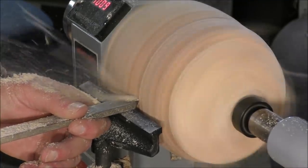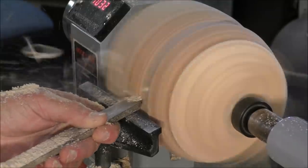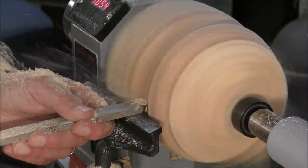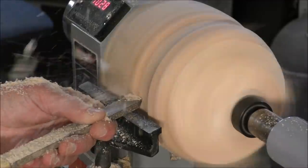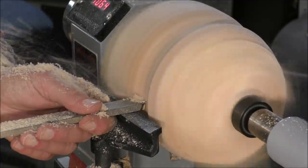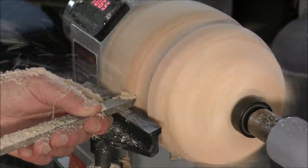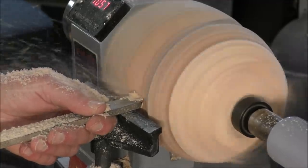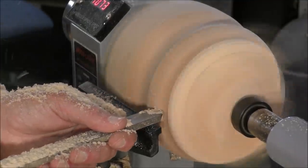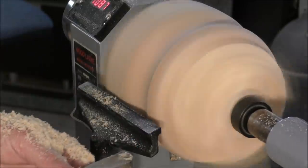We're actually going to do some of the shaping of the bowl now. I just don't want too plain a sided bowl. So what I'm going to do is take a bit of the material out here and make a bit of a divot. Like so. Now you can let your imagination run riot, there's no specific shape of a bowl. So we're just going to put a bit of detail, or quite a large detail there. Okay. And then round this. You can see a bit of shape coming there now. That's as far as we're going to go with the back end.